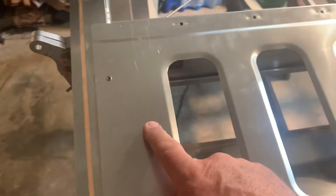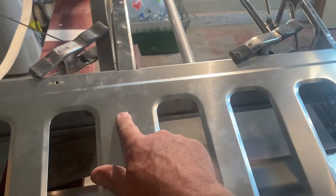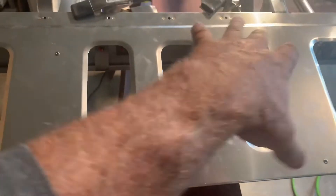Once it looks okay, everything's good up here. Then just go ahead and drill this row — these four rivets, four here. Then I make sure everything's good. I come down again and look for the blue line, do these four, and then continue on around. Do the two that go on the outside edge here. Then there's one that goes on the bottom there. It's easy there just to reach in and grab it and go ahead and install all those rivets. It's just that simple.